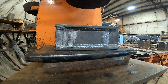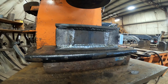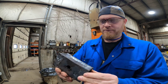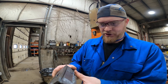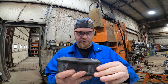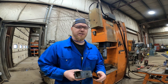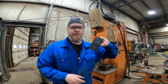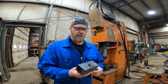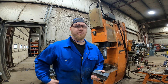I mean, I wouldn't sell this one, but that is impressively strong. No cracking, no welds broke, no delamination — just a little bit of forge scale came off. I can actually see a tiny little dip right there from where the press was pushing into it, but for a hundred tons, that's impressive. A couple of thoughts: we need to know if anybody would be interested in a block like this. Obviously it's super duper strong — that was a hundred tons and it resisted it. Let me know if you're interested in a two and a quarter inch block; it would come with a set of u-bolts two inches longer to accommodate a set of blocks like this — comes two in a pack.